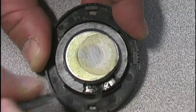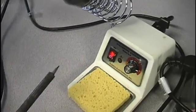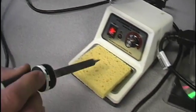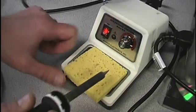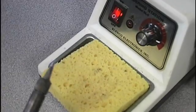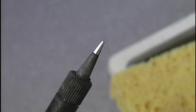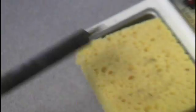I'm going to put my safety glasses on to be safe. Now with the soldering iron, when I put the tip on the sponge — hear that sizzle? See how it got nice and shiny? Before it was really nasty because it oxidizes.